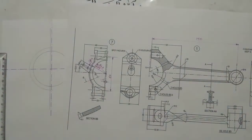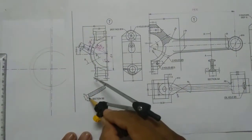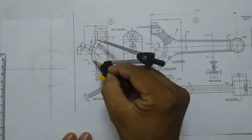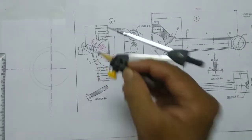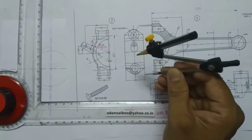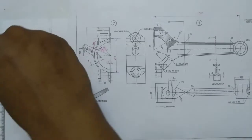Then again, you can see another arc. The radius of this arc is not given in this diagram. But in the cross section VB, it has been given that from this edge to this point the distance is 6.5 and this distance is 5. So the gap between these two arcs is 1.5mm. Just increase the radius by 1.5 — that is 30.5. The previous radius was 29; add 1.5 and you get 30.5. Draw a semicircle from the same center.